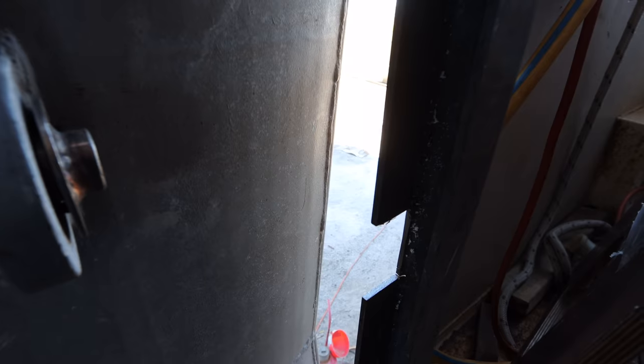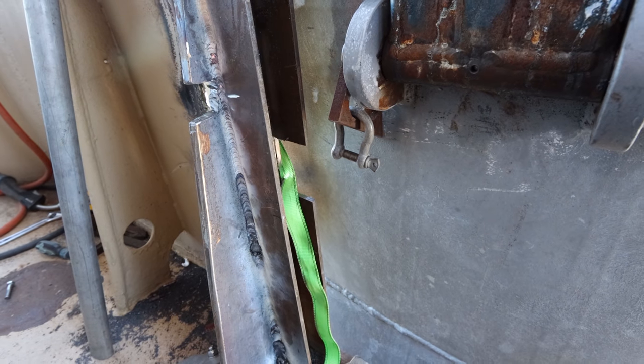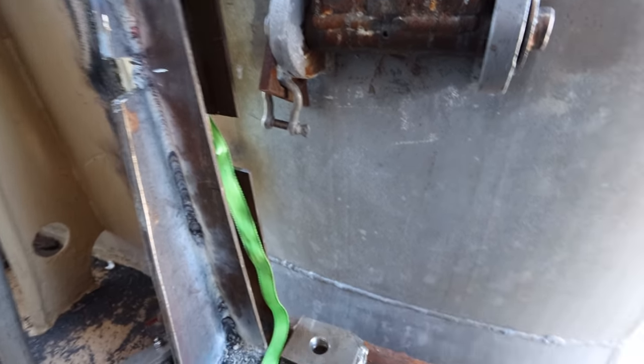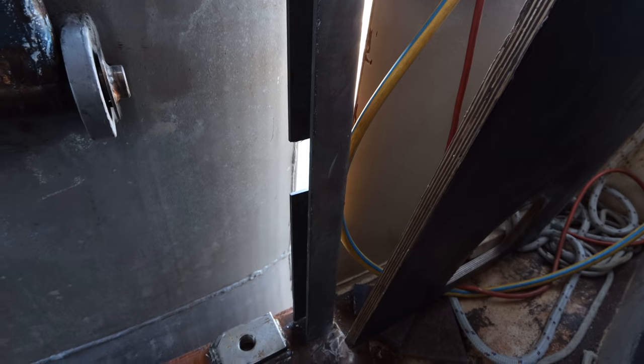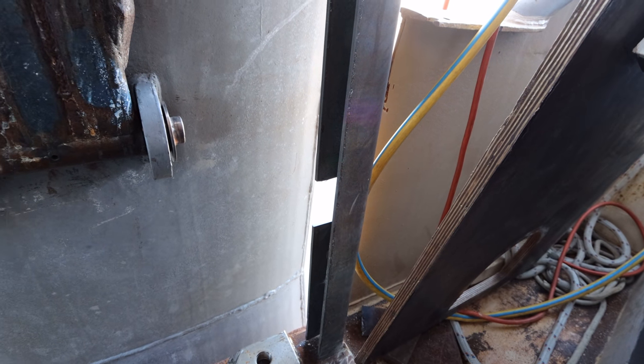Brupeg does have wings. In order to get the arms in and out of our sliders, we have to make a little adaption to each slider so that we can remove them when we need to start maintenance. I'll show you what we did. The slider itself is basically a solid U channel, and then if I spin around, there's a cutout. That cutout is on both sides, so you can see there's another one over there with that green thing dangling through. And what that does is it allows us to lift the wing up, 6 inches or something from the resting position, and we can just pull the pins on the arm, literally lift the arm straight out those slots. Now we will be putting a piece of steel that bolts in on the outside, and it'll have a plastic bracket that makes the internal dimensions exactly the same all the way through, so you won't see that step, but it allows us to maintain the arm whenever we need to take that arm off.